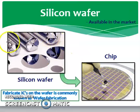And then finally organically cleaned. So at the final stage, this is the ingot — the first ingot after pulling from the furnace. And this is the final product after cutting, scrubbing, and polishing. These are the wafers available in the market. These wafers are processed and converted into small chips. There are lots of active and passive components embedded on this one chip. And this process — that is silicon wafer to chip — the fabrication of IC on the wafer is commonly known as wafer fabrication.